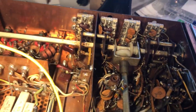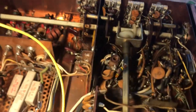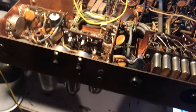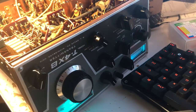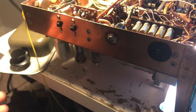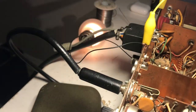I think this thing is ready to go. I replaced the fuse over here and cleaned up all the switches a long time ago, but I gave it a tune-up today so it works. It transmits nicely on the bands. The power supply is all fixed over there with new capacitors. I'm going to put it back together — it's on eBay — and now when the CW key is pulled out it will transmit like it should.